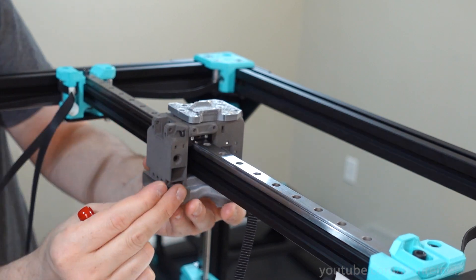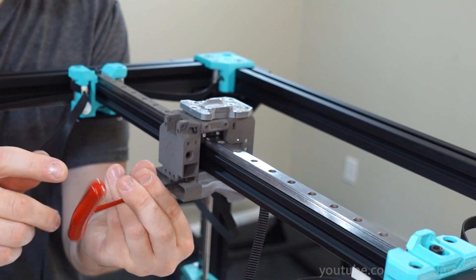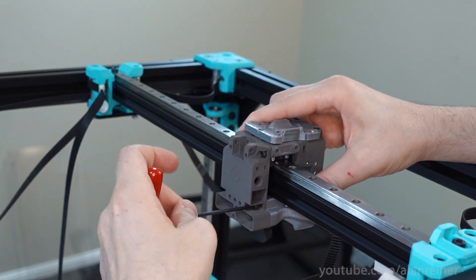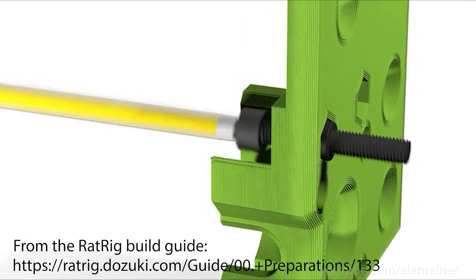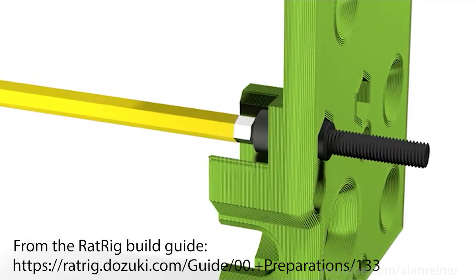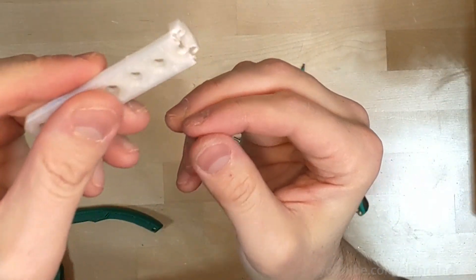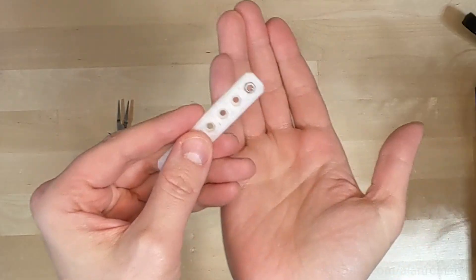So what's the problem? Well, two things. There are two main schools of design for adding threads to a part to fasten them together. One is called captive nuts, the other is heat set inserts. RatRig defaults to captive nuts for fasteners including all the EVA parts in their repo by default, and they even have a helpful video to show how to install them. There are hex-shaped insets into the material and you use a screw to capture the nuts via friction fit into the holes. This is the beginner-friendly option because it doesn't require anything other than some extra M3 nuts. But I was never a fan of captive nuts — if your holes print too small you can crack the part as you capture the nuts, or if they're too big the nuts just fall out.